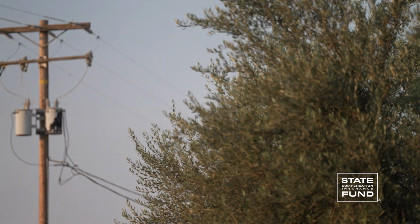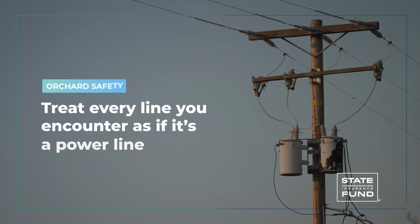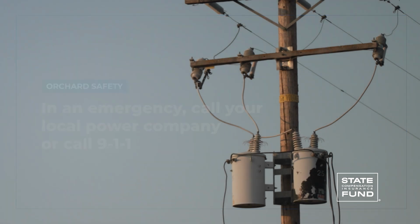Power lines are a common hazard in almost every orchard. Whether driving machinery or using hand tools, be aware of your surroundings and always keep a safe distance of at least 10 feet from all power lines. Treat every line you encounter as if it's a power line and always assume that a line is energized. In the event that you need to de-energize a power line, call your local power company. In an emergency, such as a power line touching the ground, either call your local power company or call 911.